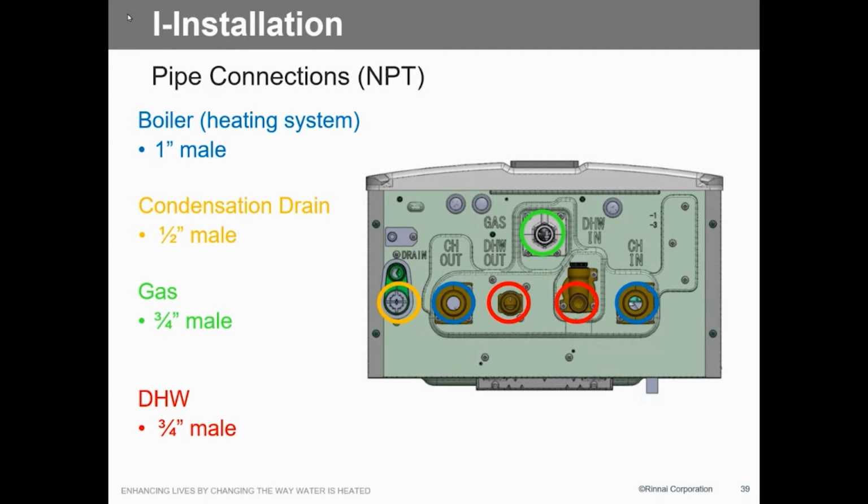So a couple different options is come out of that 1/2 inch, do a 3/4 by 1 inch bell, stick it up underneath, or come up with 1/2 inch and do a T riser above the condensate trap. Either way, whichever way works best for you. So just make sure that condensate here is air gapped at the unit, not down at the floor drain.